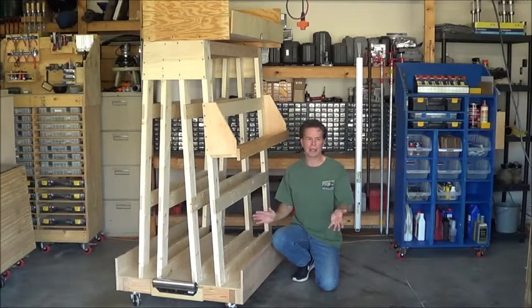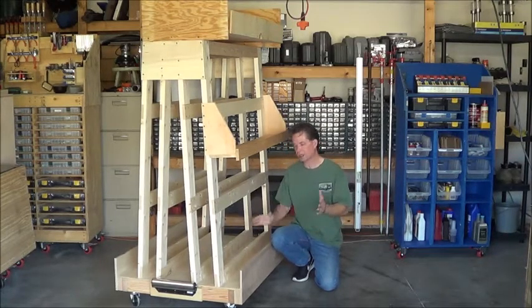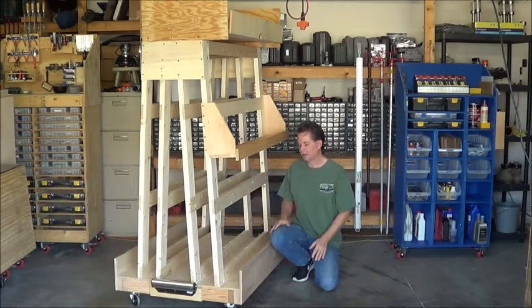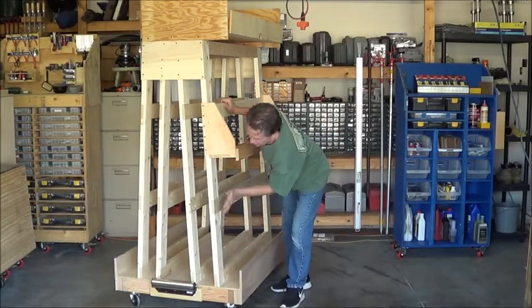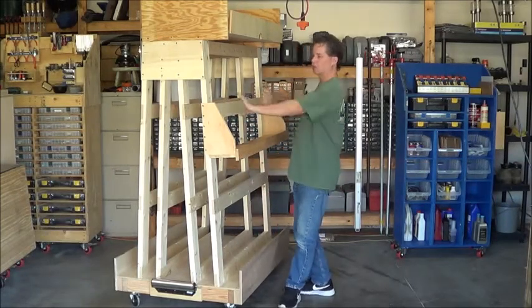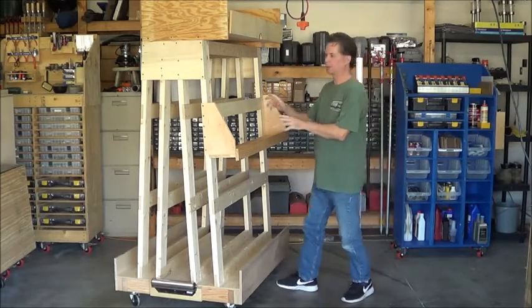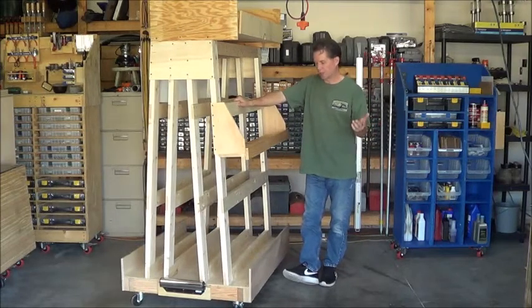So when I did that, these things were super solid. I mean, they were nice and straight and they didn't move, and that allowed me to then start to assemble it by screwing these uprights here. And once I screwed these to the bottom pieces, I could just put the cross members in, pre-drill them, and then screw it together. And it went together pretty much like a dream.